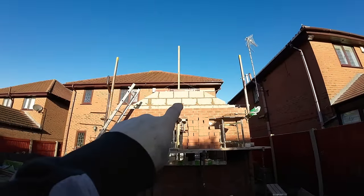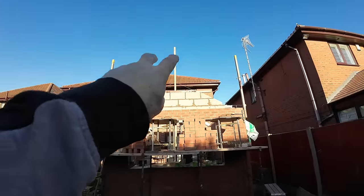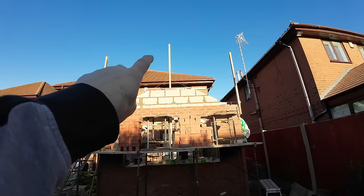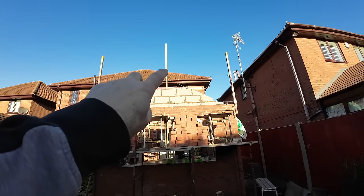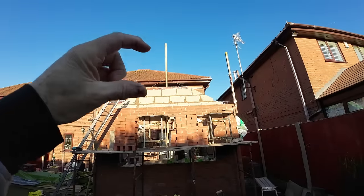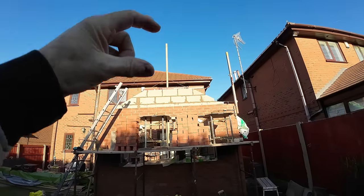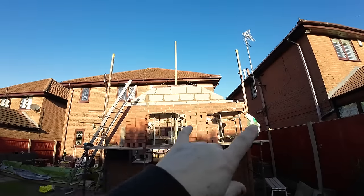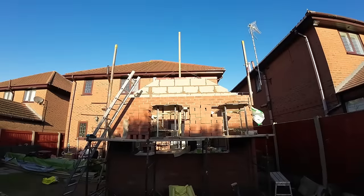There's a ridge going in the centre there, so we're going to leave that centre out. Leave it all the way down there, and just build the two triangles of block work here, either side. And then whatever height that the ridge sits at, we can bed something underneath for Neil, or unless he wants to pack it up on timber or whatever. So basically we can finish the last little bit after dinner and then get this face work up quick.